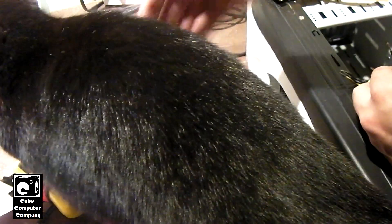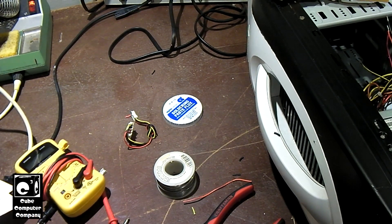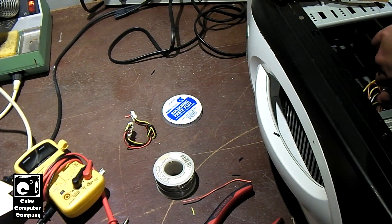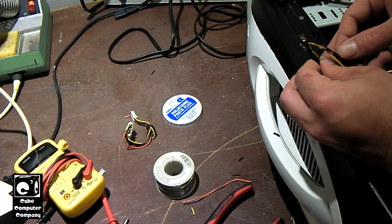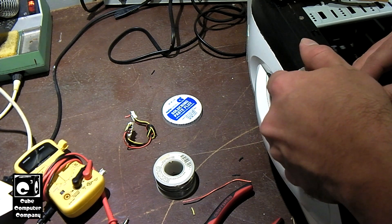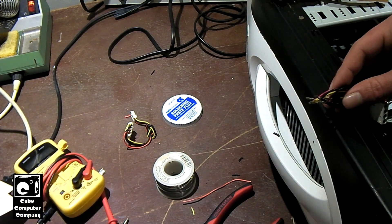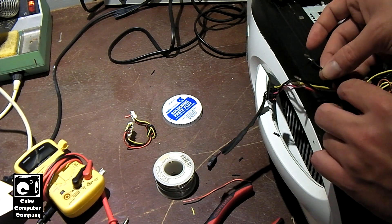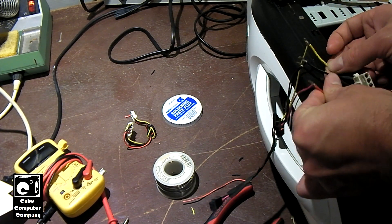I've got our helper here — don't need him near the solder and iron. I'm going to dip this in the flux here. The solder itself does have flux already in it — that's what the rosin core is. But I've found that with these wires, it generally works a lot better when you actually add additional flux. It helps the solder better adhere to the metal in the wires. I'm going to do these one at a time. A little much solder, but we'll try to straighten that out. We'll do the remaining three.